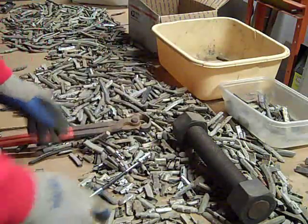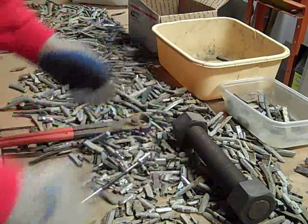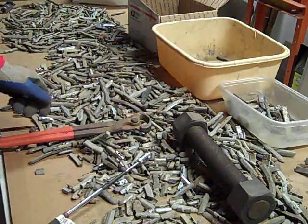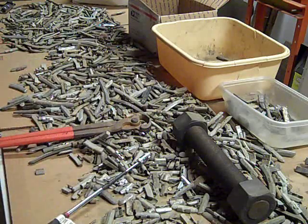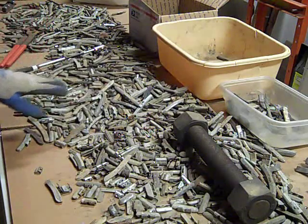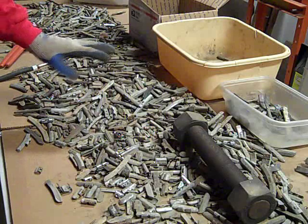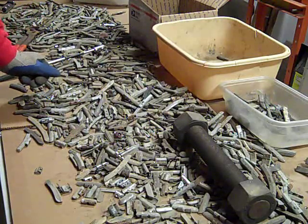That's why I take a lot of the stick-ons and just throw them in a pile so I can deal with them after the fact — use the magnet to sort out the steel ones first, and then check the others out pretty quickly. I know there are a lot of ways to do this easier. You can control your temperatures, since the lead melts in the 600-degree zone and the zinc melts in the high 700s.